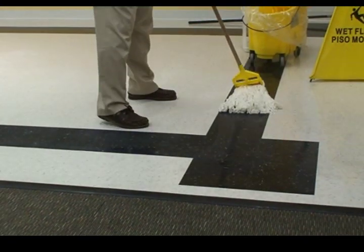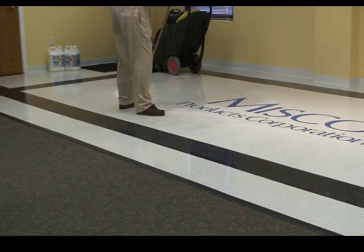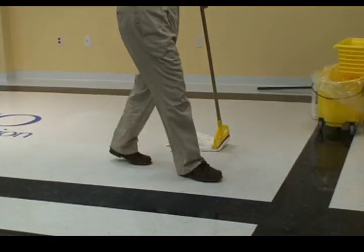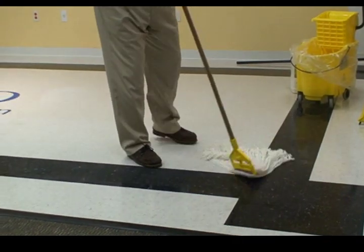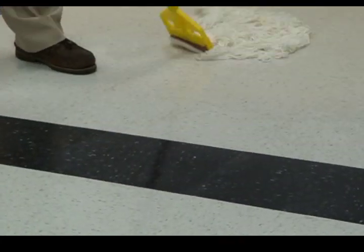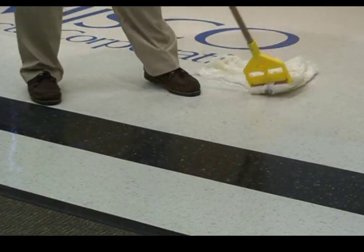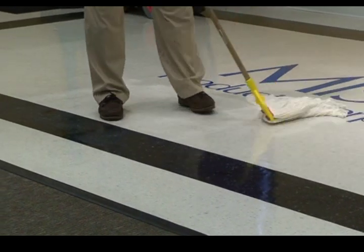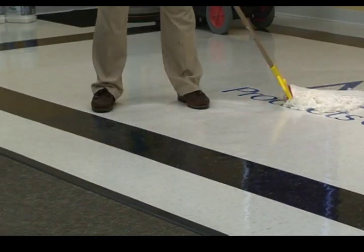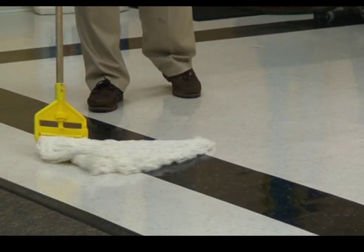That's what it's supposed to do. I'm going to make an area comfortable enough for me to stand in the center and swing my mop back and forth. I lay my finish mop flat and begin my stroking pattern, letting the mop fan out. The finish is coming off the mop and going onto the floor. I get about halfway down my section, flip my mop over, and continue my pattern. I find this to be the most rewarding element of floor care — a clean, shiny floor not only looks good, but it makes me look good too.